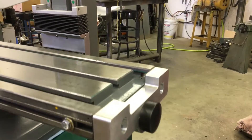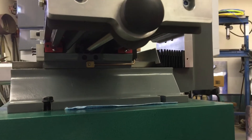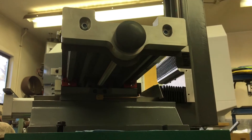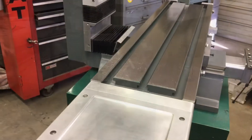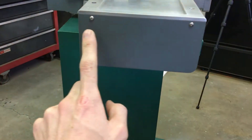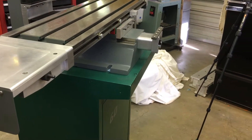Here's the thing I was trying to show you the other day but it wasn't bolted on and was just hanging around. Here's the drip edge — it's a piece of 16-gauge that I phosphated, to try to keep the coolant from wicking back down the rails and screws. I also got this plate on that covers the stepper, and there's a piece of sheet metal that goes around the back. The front hole right here is where the gutter picks up and continues along.